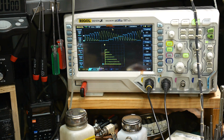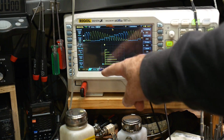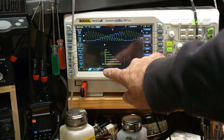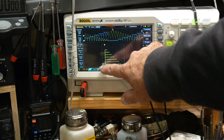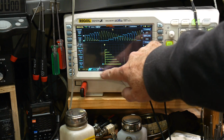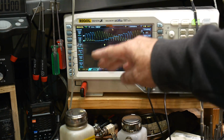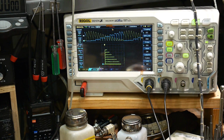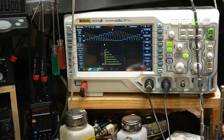Now the nice thing about having the sawtooth waves generated at the same time I'm generating the steps is that they're phase matched. So if you think about this diagram, what happens is you start here at 0, and then for, let's say, this curve, the voltage goes up, and then it goes down, and then it steps, and then it goes up to the next one. It goes up, and then down. So each one of these takes a round trip, up and down, and up and down, and up and down, every time you step the thing. So they all get referenced to 0, 0. And the nice thing now is the ramp doesn't take off until you've actually made the step.